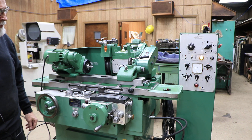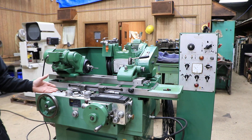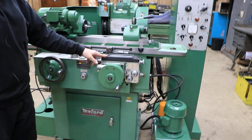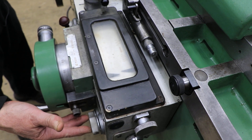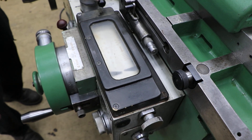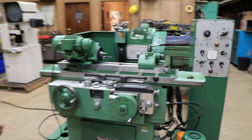You see our light came on for our spark out. After the time is up, the cycle is going to end — the wheel is going to move back, the headstock is going to stop, and your infeed is going to retract. When these machines feed, you don't actually see the hand wheel moving. What's moving is the mechanism in the rear of the machine. Watch these pointers here moving. Once we get to the stationary pointer on top, we're going to go into the fine feed. Those feeds are adjustable with these two adjustment knobs here, and the fine feed changeover point is adjustable with this knob here. At the end of the cycle, these will go all the way back, resetting your infeed amount. The amount of infeed is determined by the cylinder on the back — that's probably close to 10–15 thousandths infeed, maybe longer.